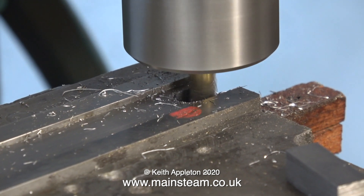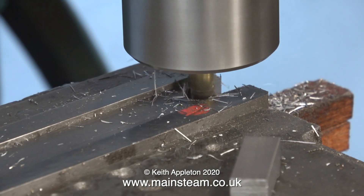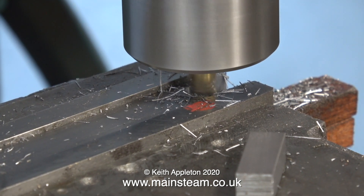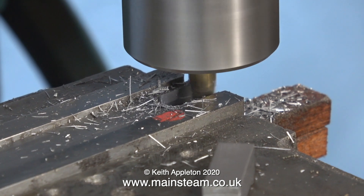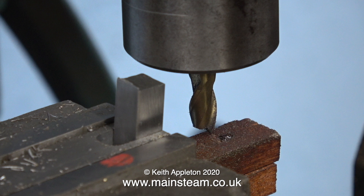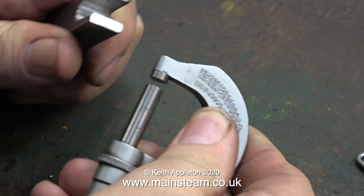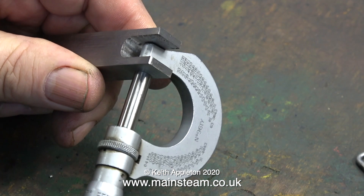The only minor problem is that this slot needs to be three-eighths of an inch wide, not five-sixteenths, so in the clips you're currently watching I'm slightly widening the slot. I'm making sure I always go towards the work and never away from it — this will stop the milling cutter from grabbing the metal. The process is: feed the cutter in at the front; when it gets to the end of the slot, wind the handle on the table to move the cutter to the other side, so you cut both sides with the cutter always cutting against the work. This is not quite so essential if you're taking very fine cuts, but generally speaking always mill towards the work. A quick check with my micrometer tells me that both sides of the slot had exactly the same thickness, and the finish in the slot is quite good.